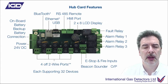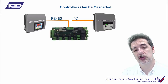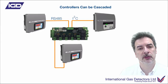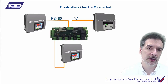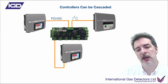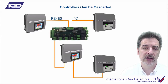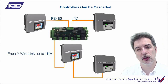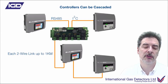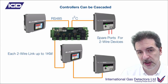If you've got your controller with two displays connected, you can also cascade down to another control panel. The master panel at the top will see everything connected to the control panel below it, and you can cascade down another level to another control panel. Each one of those cascaded links could be up to a kilometre long. So with two cascaded panels and a remote display, you could be up to three kilometres to distribute this across a network.